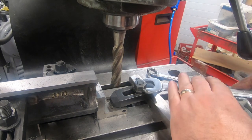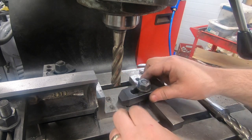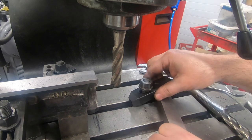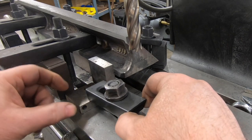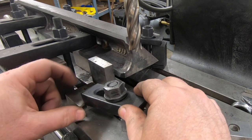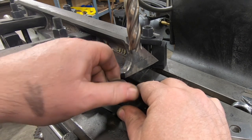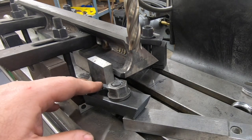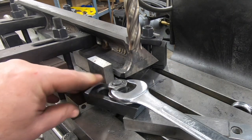So to machine the left side of the straight edge, which, since it's facing away from me, I'm considering the left side, I need to move this stop block out of the way. I'll just reposition it to the back to give me some stability forward and aft. That way, if the end mill decides to grab, it really won't be able to move the straight edge from its position on the table.